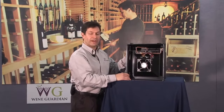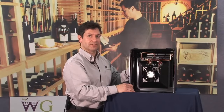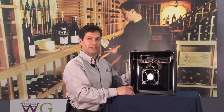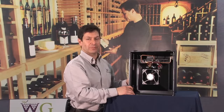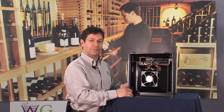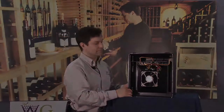This particular humidifier, the pad is rated for 3,000 cubic feet. It's a standard air conditioning pad with an algicide coating, so it is mold resistant, easily cleanable, and replaceable. The pad should be looked at every 6 months to ensure that it is clean, free of debris, and has not developed mineral deposits from hard water.